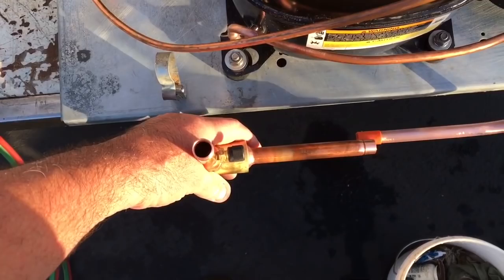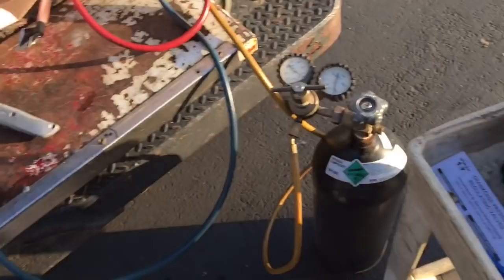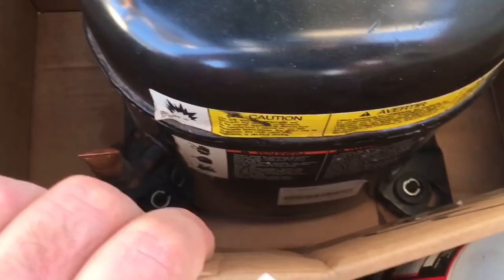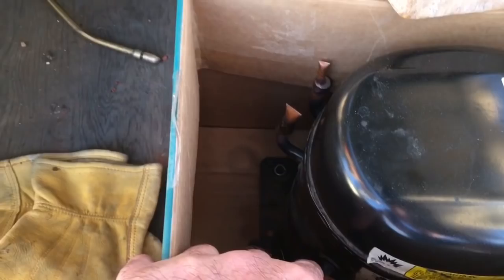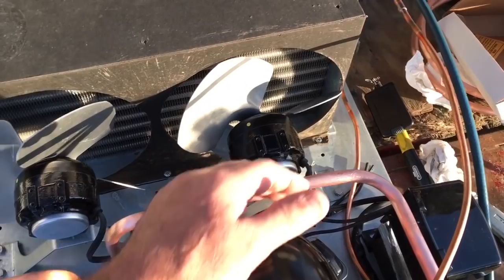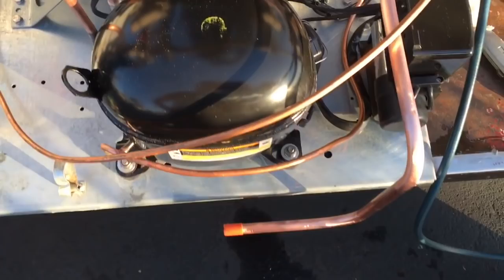When you're changing over from the other compressor, the suction line is here on this compressor. This is the new compressor, the NT2180GKV, and this is the T2180GK. So the old compressor suction is here. You have to reroute if you're going to reuse the old suction pressure regulator. You probably couldn't get it over here. So you'd have to do something else like I'm doing here. All right.